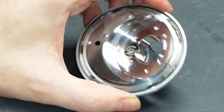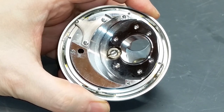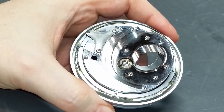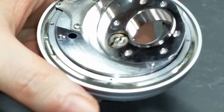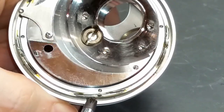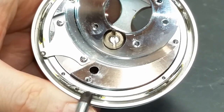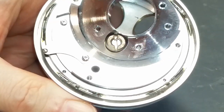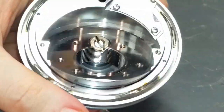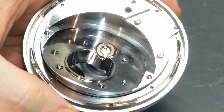In the interest of full disclosure, I'm going to proceed with the rebuild so you can see how it's done. But to be fair, I'm not going to be reinstalling this on the scope. The detents on this thing are worn — the metal plating is worn down into the brass and there's a little bit of shallow cupping where the surface has worn out. In my opinion this is beyond its useful service life, so I will not be putting this back on the scope. I will proceed with the rebuild, and when you see me put a unit back on the scope, it will not be this one.